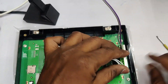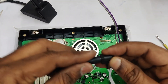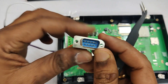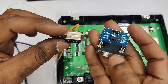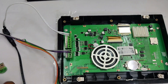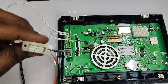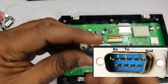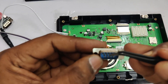The terminals are easily removable — you can remove the terminal, plug in the wires, and plug the terminal back. This socket can be plugged to the 12 volt 2 ampere adapter which acts as a power source to the DWIN display. For communication we'll be using RS232, so a D connector is required. Either a male connector can be used. On the other side is a female RS232-to-TTL. The other type available is a female D connector — for this a matching male D connector with TTL pin PCB needs to be purchased.